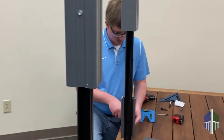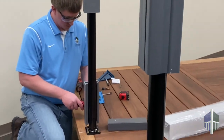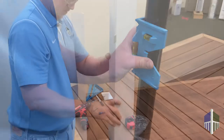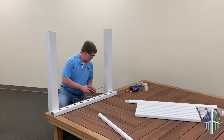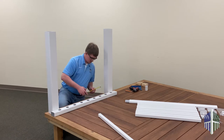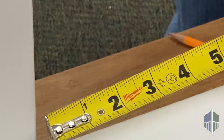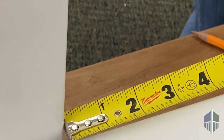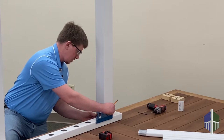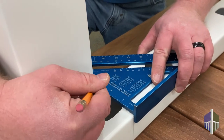The classic railing system is installed between two posts — sleeve or load bearing — or directly into a wall with proper reinforcement. Once your posts are in place, start by laying the bottom rail out. Working from the outside in, measure between the post sleeve and the outside edge of the first hole on the other side. Make sure the distance is equal on both sides. Once you find the measurements, mark the rail for cuts.